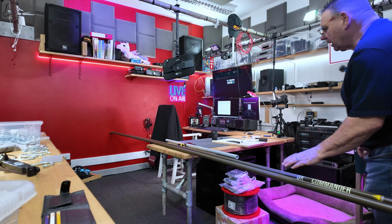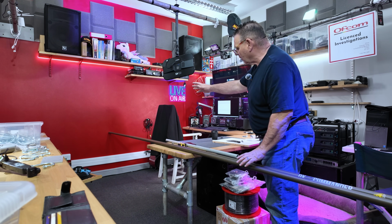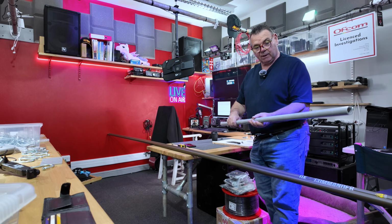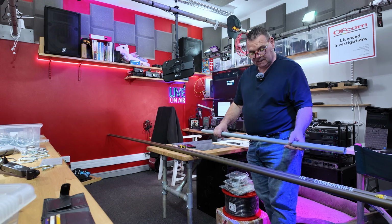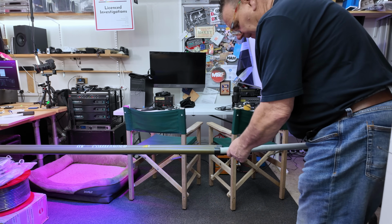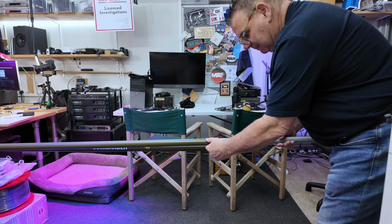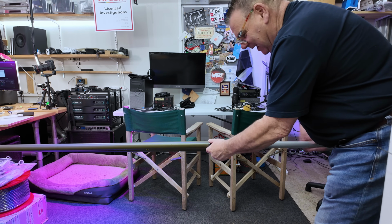So in terms of hardware, I've got a pair of rapide poles, 7-metre poles. I've taken off the ends, so they should be roughly the right length. And we're going to join them, this will be the very middle, with, actually this is a ground post for a DXCommander rapide. However, we've got some minor issues, and I want to put that in there, and I want to put the other one on the other side. There's a little bit of tolerance there, which doesn't normally matter, but if it was a vertical, I don't want them falling off the ends.